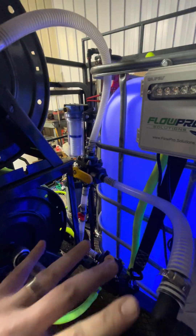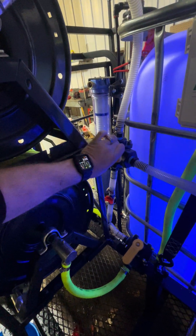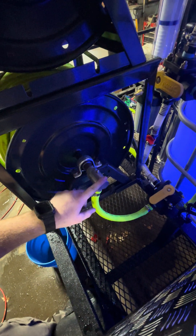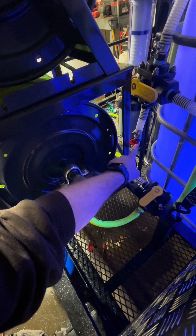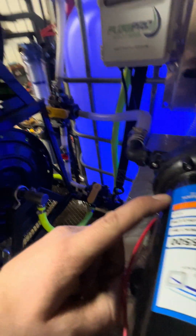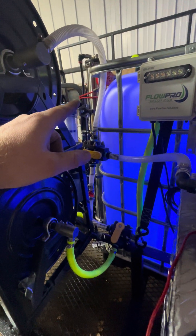If I'm soft washing a roof, pre-treating, post-treating concrete, then I will have the lever selected up, which will run the solution to my hose reel. If I have the lever selected the other way, the water will run down to my water-fed pole. I have a plastic ball valve on here because when I hook up to a spigot and the water is going to be running that way, I don't want the water to run up. So I will keep the ball valve shut and then open it if I'm going to be pulling water from my soft wash pump. That is basically my means of getting water to my tank and to my water-fed pole.